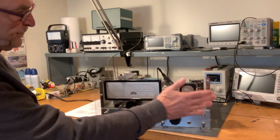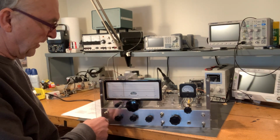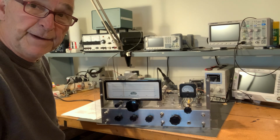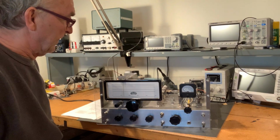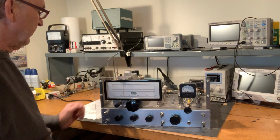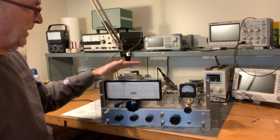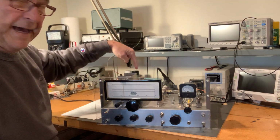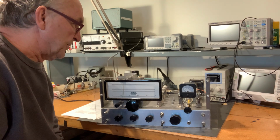Anyway, the front panel is made from plexiglass, and that was done for my ease, to be able to mechanically place things and see what was going on. Right now I plan on leaving it this way, but I am thinking about making a little cabinet over it. I don't want a big massive cabinet. I'm thinking of a small thin aluminum cabinet that rides right over these rails and is just tight. But I do need an opening to open the lid, because I need to get access to these 3 coils, since that's how you change the band on the HBR series.